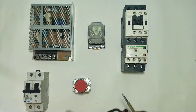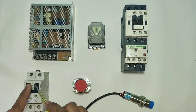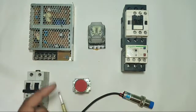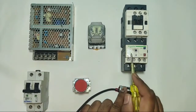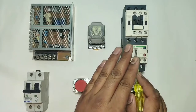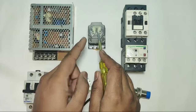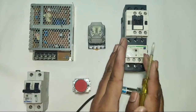The sensor operating voltage is 5 to 40 volt DC. For this 5 to 40 volt DC, we connect one SMPS. This SMPS converts 220 volt AC supply into 24 volt DC. Because our sensor is 24 volt DC and the contactor motor starter is at 220 volt, we first operate the sensor to a glass relay. The glass relay operates at 24 volt DC.